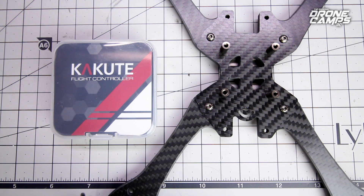It does have a pre-release version of Betaflight on here — Betaflight 3.2. Very interesting, it has a floating IMU. The accelerometer is actually soft mounted above the flight controller with a cable extending up to it. It's very neat because it isolates a lot of the vibration problems that the gyros have on some of these F4 boards.